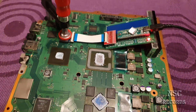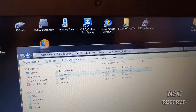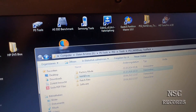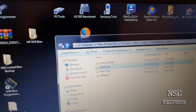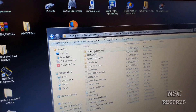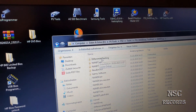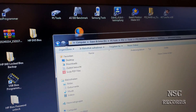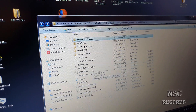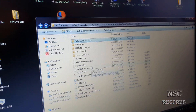As shown in my video, you may still have the NANDway tool pack folder. You just go to the NANDway folder, and there you'll see a folder called 'differential flashing.' This folder needs to be empty, because after you have patched it, it will create two new text files inside it.